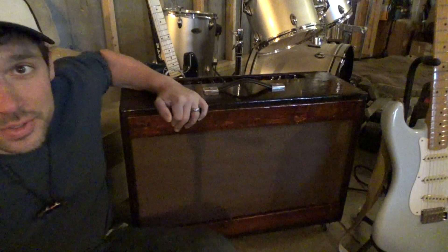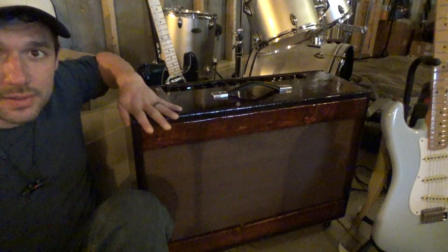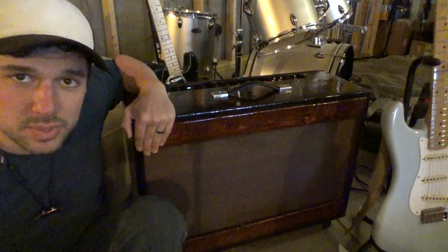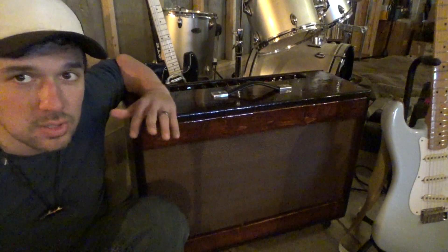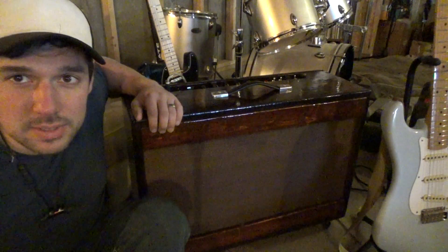I know Brad the catalogist — I'm not great at improvising or doing stream-of-conscious noodling, which is his specialty, and it's pretty cool stuff. Anyway, the next thing we had to conquer was the cabinet build. We did a finger jointed — box joint, dovetail, whatever you want to call it — and a polyurethane finish. I'd never worked with polyurethane before so it was challenging. I'd worked with polycrylic on the last build, the 5E3 build, which is a very similar design. With polycrylic you could just layer after layer after layer and use a fan to speed up drying — huge no-no with polyurethane. But anyway, it came out decent enough. Here's the cabinet build and then we'll say bon voyage.